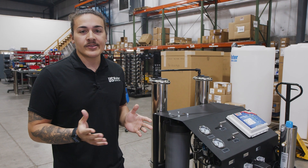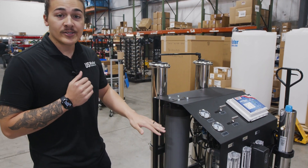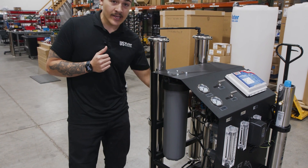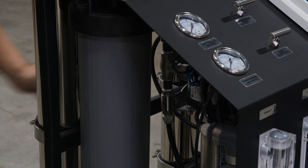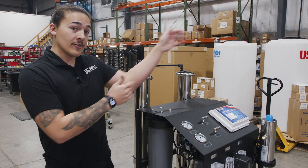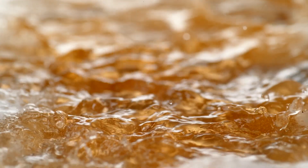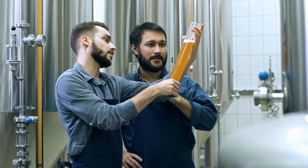When we first started manufacturing these systems, we were seeking an all-in-one solution. The first step is an onboard sediment 5-micron pre-filter. From there, the water comes through a blending valve. If you wanted to achieve a specific TDS, we can actually blend in some of your feed city water with your RO water in your fill tank. The blending valve lets you change the TDS of your water, so if you're brewing different types of beer — from a stout to a pale ale — you can achieve a specific flavor profile that suits that brew on that particular day.